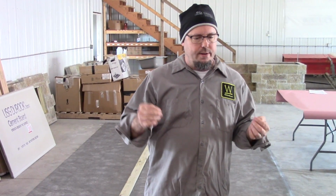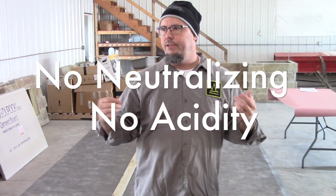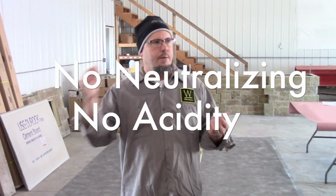The nice thing about the Reax is there's no neutralizing, there's no acidity to it. It's an oxidation process. So it permanently gives you a color change, and it stays there, whichever it may be. It will give you actually more unique characteristics than acid stain because it'll pick up more minute differences than you get from acid stain. So you'll get a lot more variation from light to dark with this. But you put it down, you let it do its color change, anywhere from 15 minutes to 2 hours, depending on temperature and conditions present, and when it's done, it's done. It'll go from purple to whatever color it is, and it's finished.